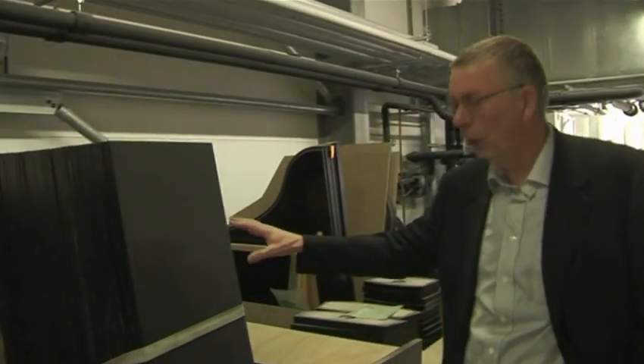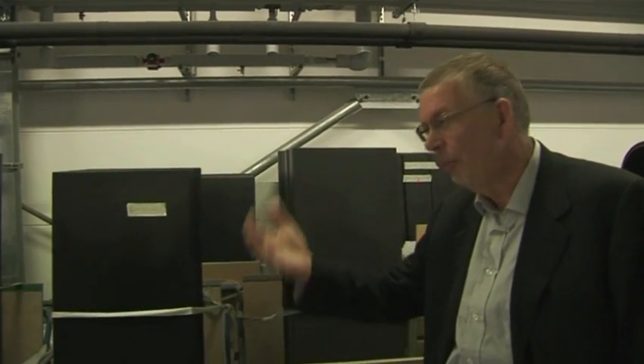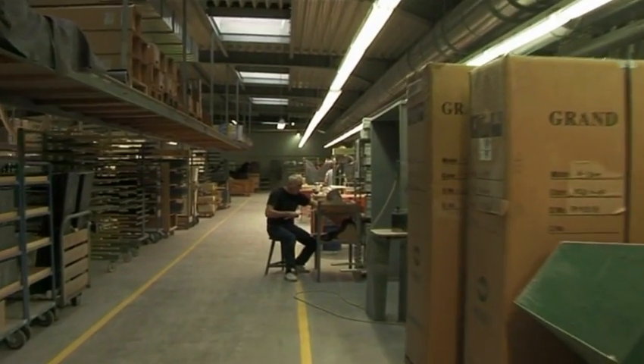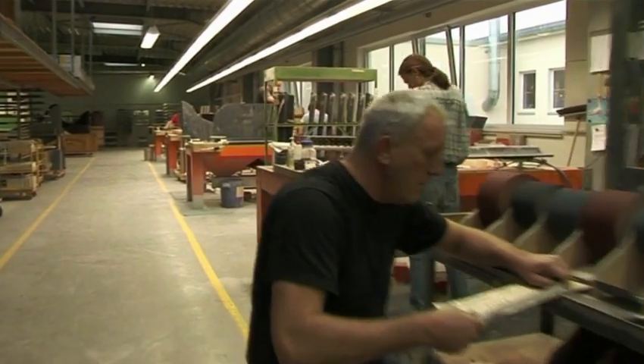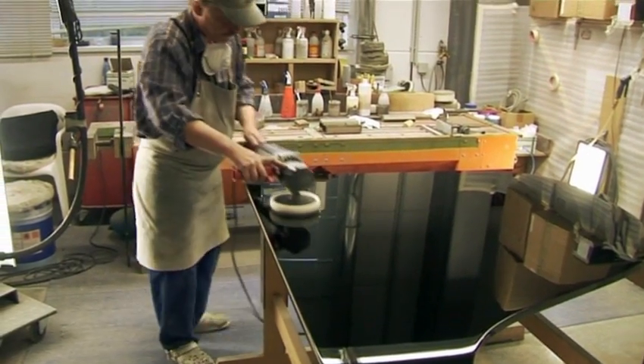After drying for three to four weeks, the parts are sanded and then polished to a high gloss finish. The lacquer, which is either sprayed or poured, has a total coating thickness of one millimeter. After gradual sanding, however, it is reduced by almost half to about 0.5 or 0.6 millimeters. This reduction of thickness reduces lacquer stress, enormously increases durability, resilience and stability against cracks due to heat or cold.